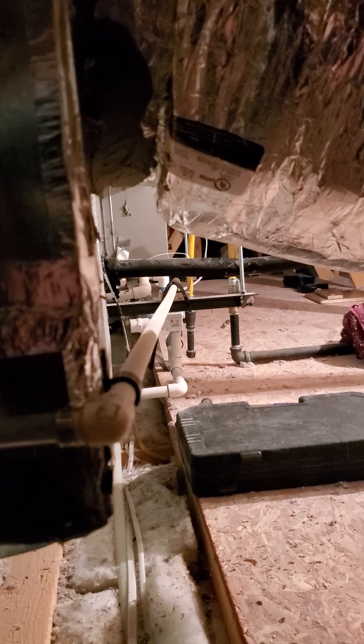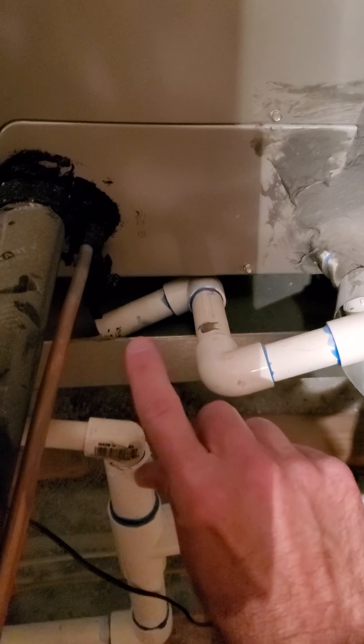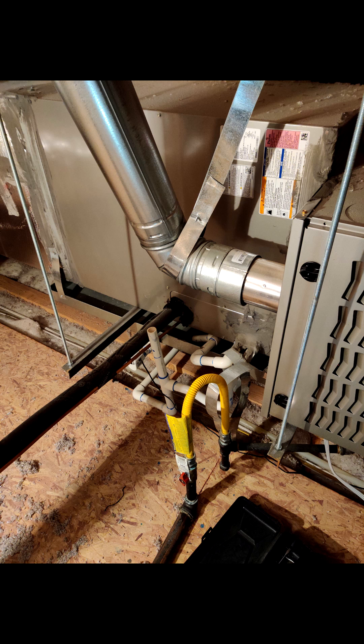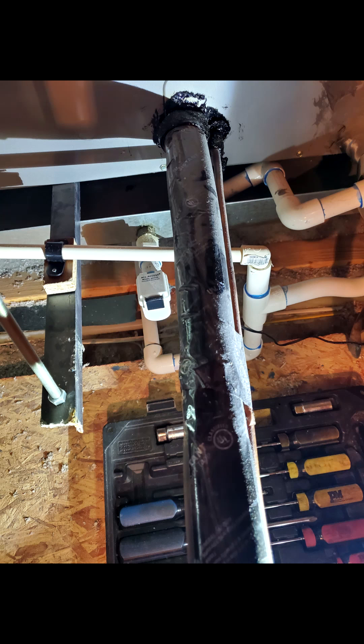There's the drain, which I'm not entirely happy with - I'll probably wind up tweaking this a little. It's just a band clamp that holds some half-inch flexible pipe, but you can see it's kinked up a little bit. Then that comes down to an elbow that goes into some half-inch PVC that I've spliced into the HVAC evaporator drain. This standoff pipe was quite a bit taller and I cut that off with a Sawzall, then I've got the drain running in there. Probably not up to code, but for homeowner DIY it doesn't matter that much. That drain goes all the way to the outside of the house.